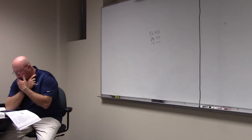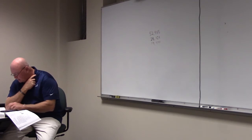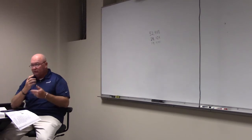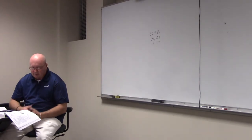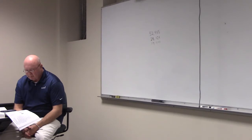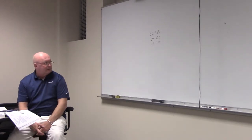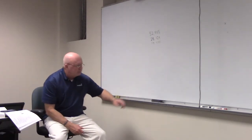Let's just say we do C. So we had how many units? 30. And so number 26 to 30 says we do what? In column C, 15 kW, plus one for each one, which would be 30, right? So that's 45. So it says you can take the lesser of the two if you read that. Okay, so that's why they did that. I agree with them then. I don't think they're wrong. A little complicated, but I agree that 45,000 is the correct answer, okay? 45,000 for a range.